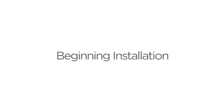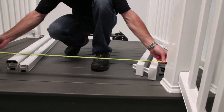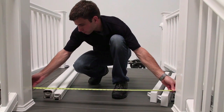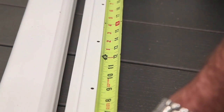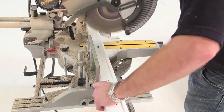We're now ready to prepare your railing. Start by measuring the distance between the posts near the top and bottom of the posts. As long as the posts are plumb, this distance should be the same. All rails should be cut 5 and 1/4 inches shorter than the opening of your gate. Cut the top rail and bottom support rail to length.